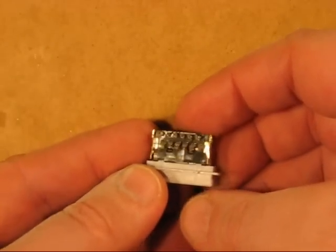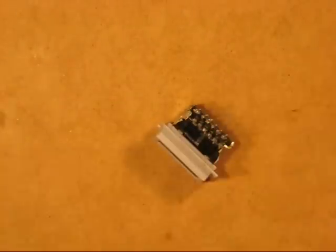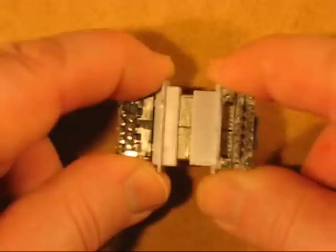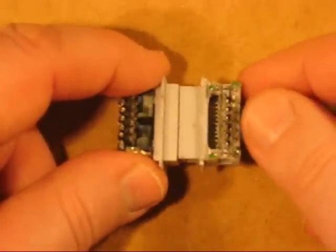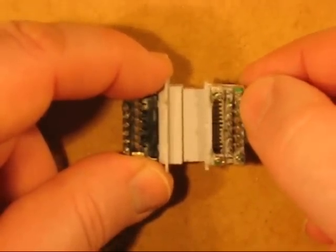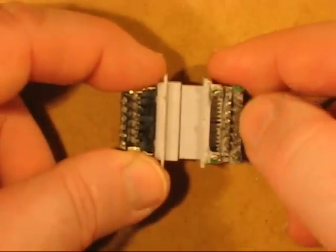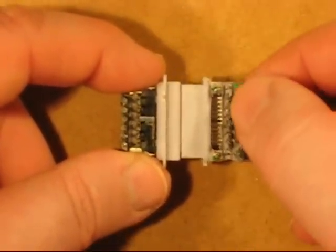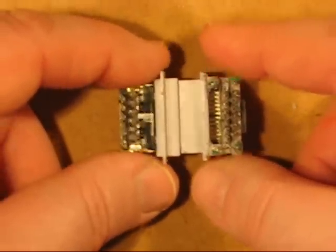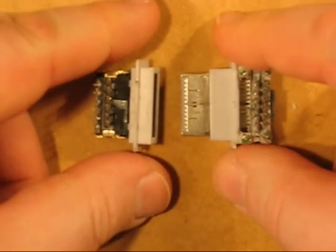This is the result — quite neat. All the dust has been blown away with some compressed air. These are the two halves which are put together inside the system. The other piece has been completed now. It's a good idea to make sure that each of the pins connects to their corresponding places and that you don't have any shorts — literally test each pin in sequence and against their neighbors, using the continuity tester to ensure there are no contacts that shouldn't be there.